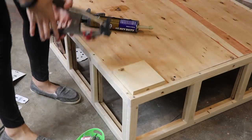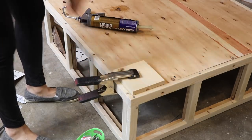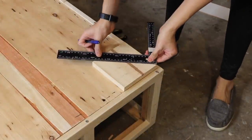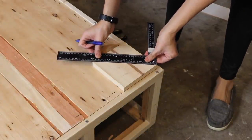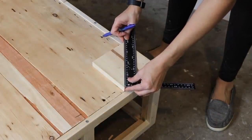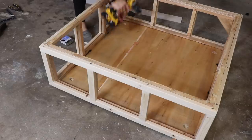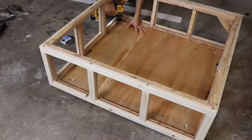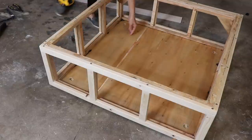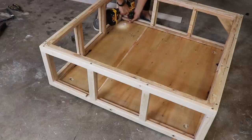And so then when I flipped it over to put the legs on there, I realized that the particle board, or the board that's at the bottom, is not going to be thick enough to hold the screws. So the screws were going to pop out on the other side. So I improvised and I made the support right in between, and I just took some of my wood that I used for the top of it. I just cut some pieces that are perfectly square and just glued them to the bottom, and then through the other side I did screw them in and just flipped it over and put my legs back on. Or not put my legs, but put the hardware on and then my legs.